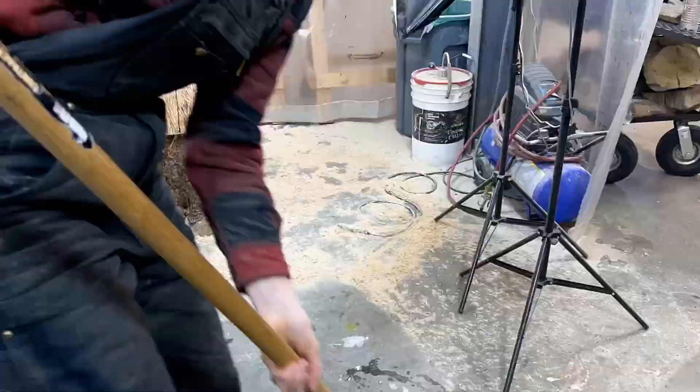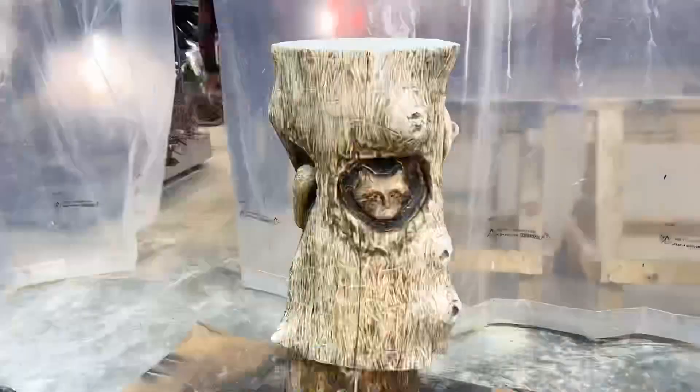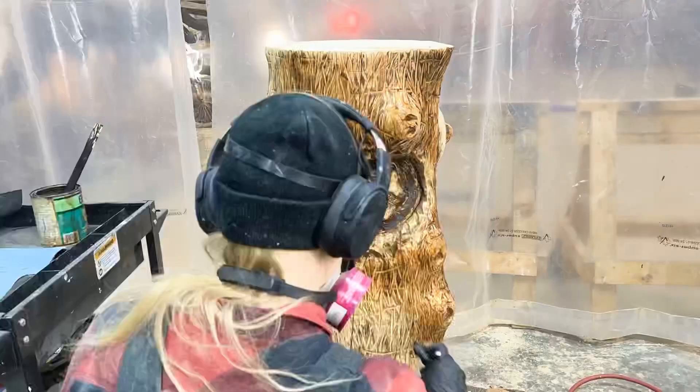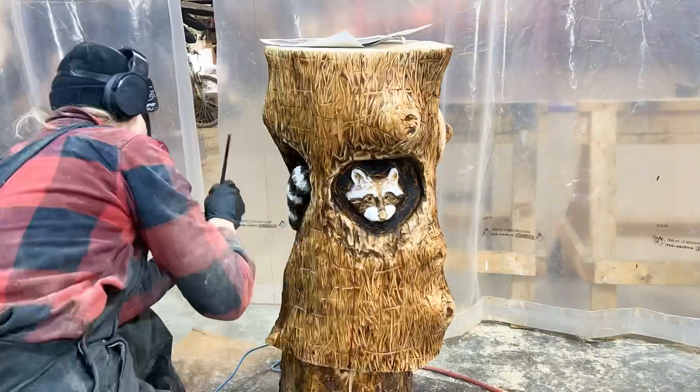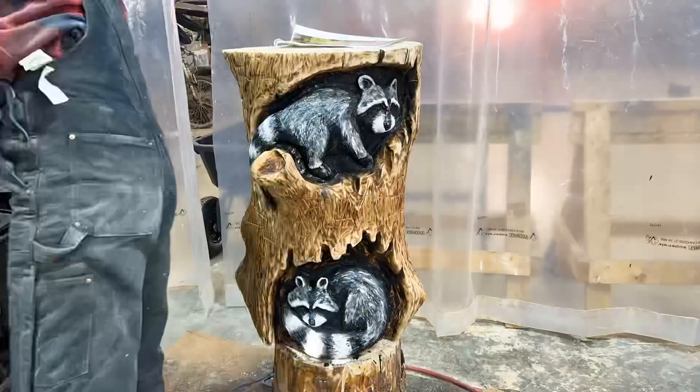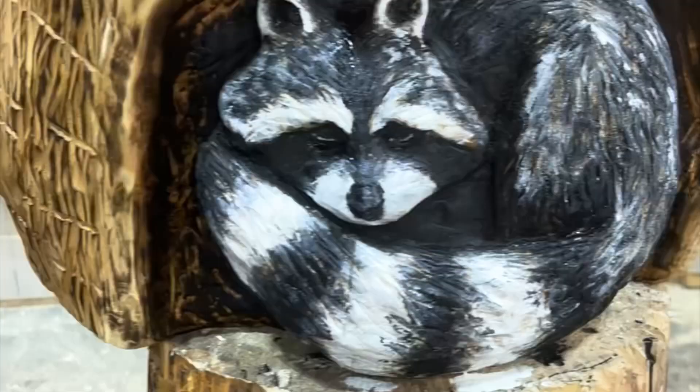Next is cleanup — I sweep up most of the sawdust mess and get ready for the paint stage. I start with an airbrush coat of light brown varnish across the bark texture and within the tree holes; a regular paint brush would also work fine. For detail paint I prefer using a paint brush — my art background is in painting so I find this most familiar. Painting is my favourite step. Instead of painting on a 2D canvas I get to paint a 3D surface, which is so much more exciting. For paint I'm using outdoor-rated rust paint — Rustoleum is a common brand, also available at most hardware stores. These are really durable paints and hold up well to outdoor conditions.